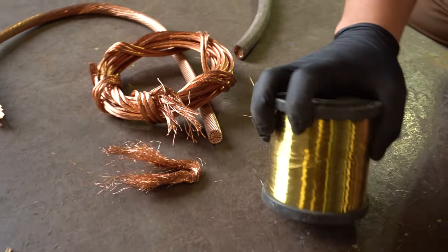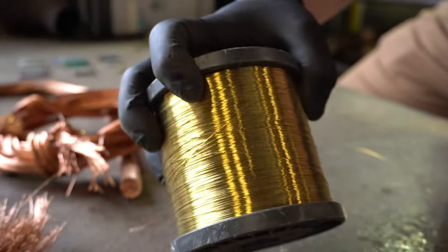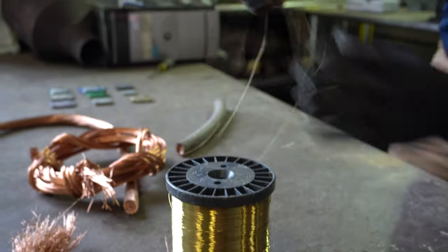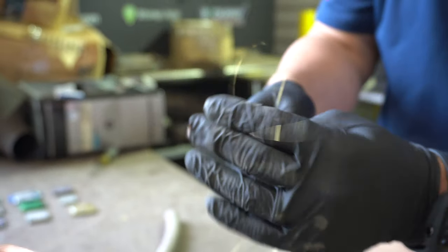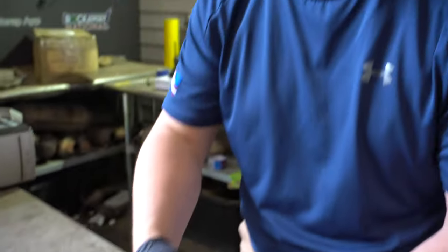Now this is another type of wire that looks just like this copper, but this is called brass EDM wire. Brass EDM wire is very thin. It can also be called hair wire, and it's used in all types of applications. When you look at these, it's normally going to be very thin — you can normally take it and break it in half. What you want to be careful about is when you put it in with your brass. Most scrap yards are not going to downgrade you; it should be a normal yellow brass price. But if you deal with really good scrap yards and you have a lot of the brass EDM wire, you could actually get a better price as long as it's contained, just because of the process that it goes through.